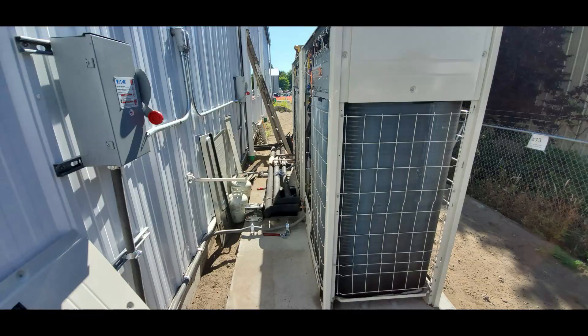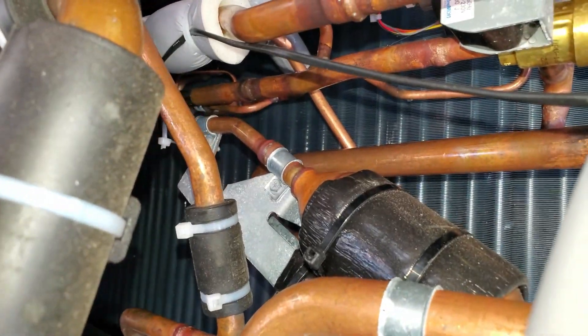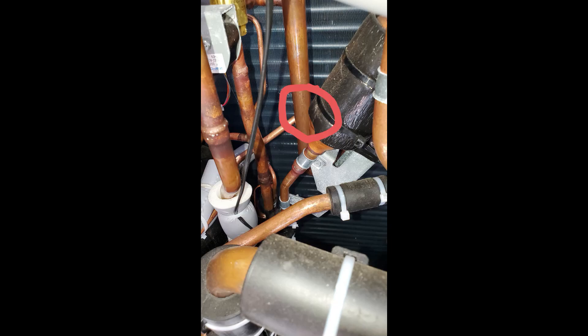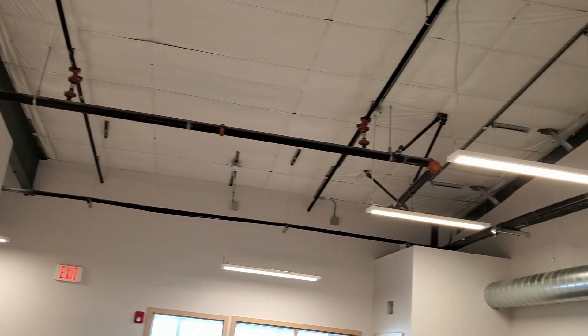All right, we're about to pull in, so let's jump right in. The first thing I always do as soon as I get to a job site is walk the install to check for any issues or red flags. Murphy's Law gave us a beauty first thing in the morning — found a small leak inside the condenser at the back where two pipes must have rubbed together during shipping. Won't be too bad of a repair, but it will definitely limit how much we can get done today.